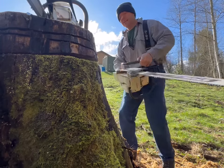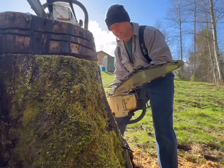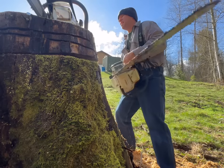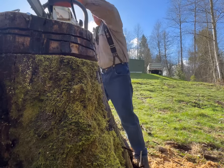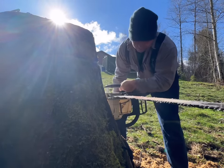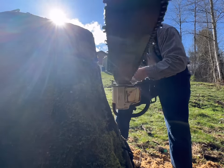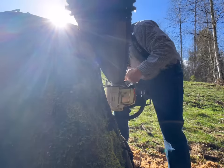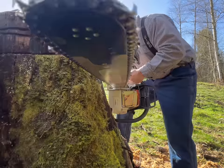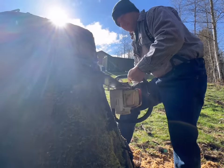Here's the three points — they're kind of similar, still got room between the bottom of the saw and the swell butt. Now as you get into the four points, they're a little bit closer. When you get into this situation, if I don't have that dog gripped in, it's going to rub the bottom of that saw and it starts to get difficult to hold that saw up and make my cut.